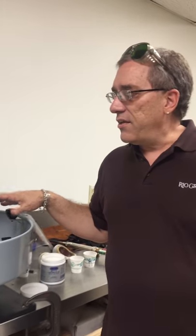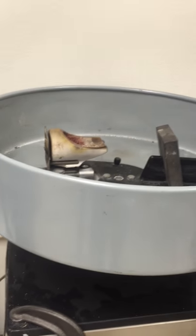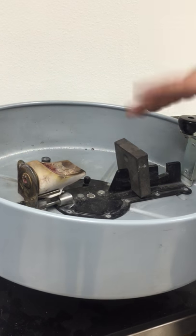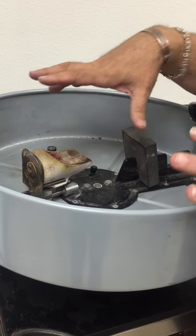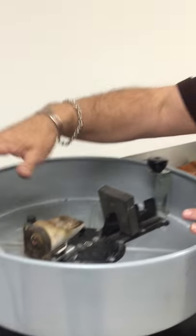I like this caster for a small shop because you can bolt it down, and if it's in the way you can take it off, mount it up on the wall, hang it from one of the holes in the base, and bring it down and clamp it when you're ready to cast. The entire tub spins, which makes it much safer than a stationary tub with just the broken arm spinning. If the arm is spinning and you have an overfill, metal comes flinging out and can spray across the room. With this one, because the whole tub spins at the same rate as the molten metal, if metal overfills it pours down into the tub and is collected there — it doesn't go spraying across the room.